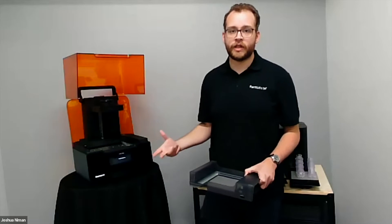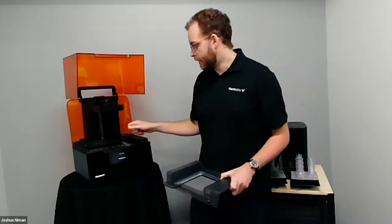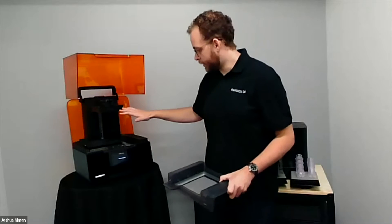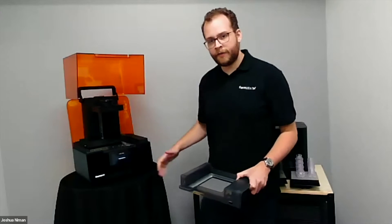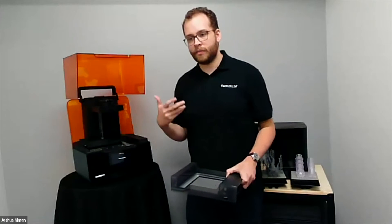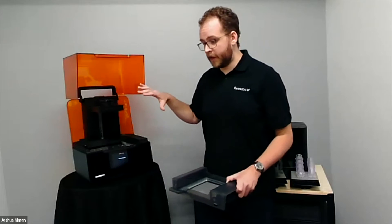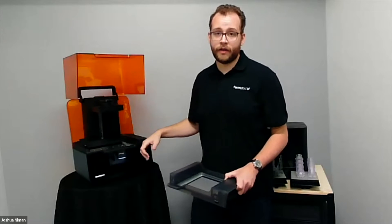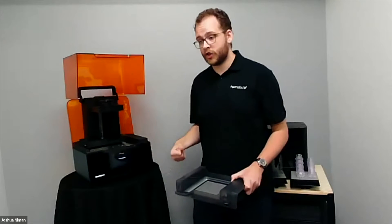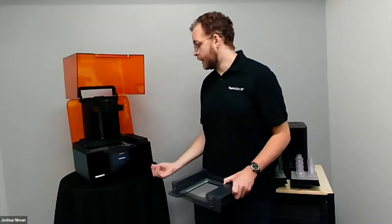It's super easy to keep these machines up and running. If you need maintenance or replacement parts, it pops out with a thumb screw and a few hex head screws — a really simple procedure. One of the major innovations Formlabs made early on was inverting SLA and shining the laser up from the bottom, rather than from the top down as in more traditional industrial machines.